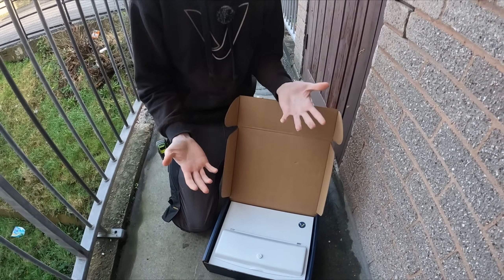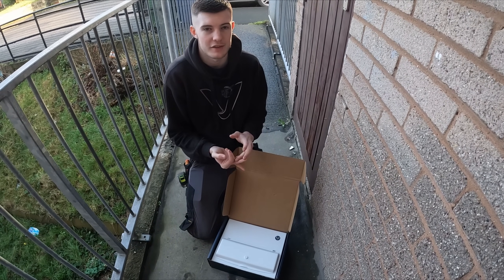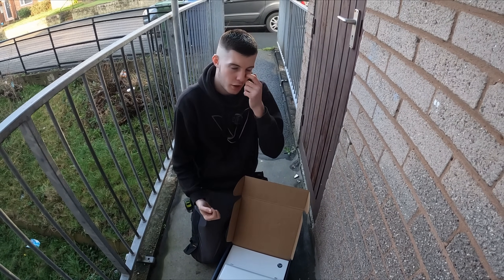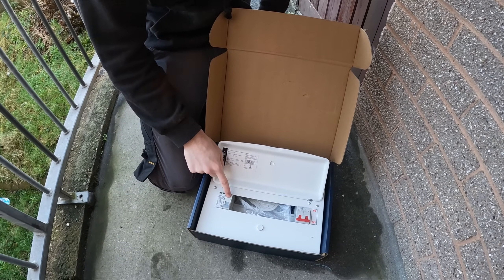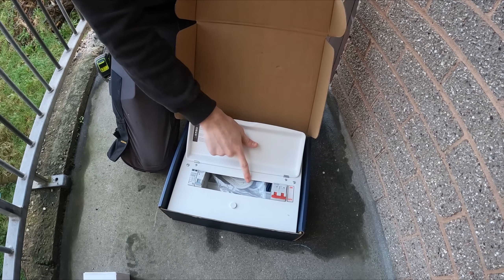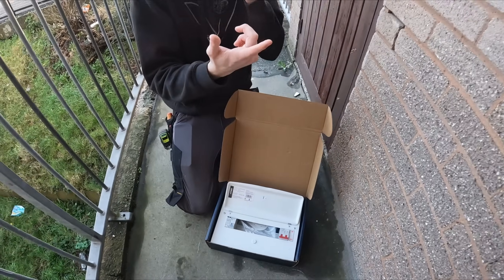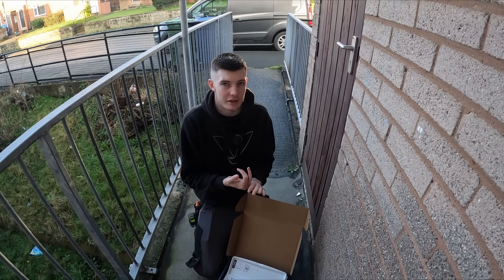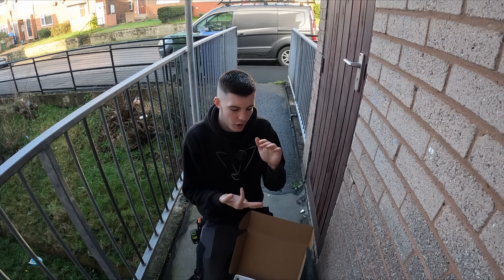So we're getting the Verso board out and I'll show you how I like to prep my boards. I forgot a tails gland — the one that goes in the bottom to bring in your 25mm tails and your 16mm earth. So we're going to space the board off and come in the back through the grommet strip. The board we're fitting is a lot bigger — we've got surge protection with the MCB, the main switch, and we're going to have RCBOs. You can tell the smaller cables are the lighting cables, so we've got two lighting circuits needing two 6-amp breakers.